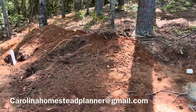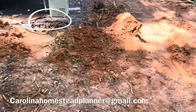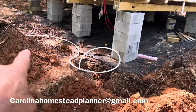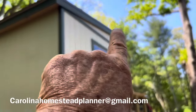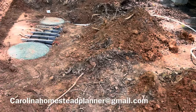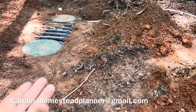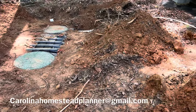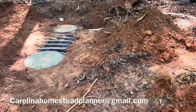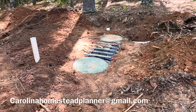I think today's Thursday — I'm shooting this video and they're calling for another massive bunch of rain. We're putting some water in the septic tank because this thing has got one flat roof that comes back, which means all the water is going to flow here. What we don't want is to fill in between the hole and the septic tank and have the tank, being empty, float right up out of it. So we just hooked a temporary piece of pipe into the inlet side and we're putting half or better water in there so it doesn't float up in all this rain — we're supposed to get violent thunderstorms and a boatload of rain this weekend.